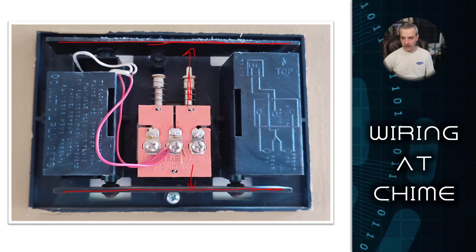This chime had a loop that connected to this screw terminal here and it supported two doorbells - one on the back door and one on the front door - but this one only had the front door doorbell. So it only had the loop going to this screw terminal here and then the ground right there. To bypass that chime, I moved the wire off of this screw terminal to this one right here, which allowed the full loop to continue and that's how you get the full 18 volts to the door by bypassing this chime. That's what was recommended by the instructions and everybody else suggested doing something similar. However you bypass this particular chime is up to you - I just moved it from one screw terminal to the next and that completed the circuit.